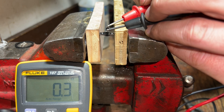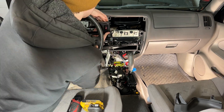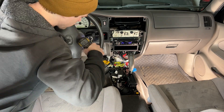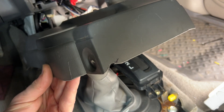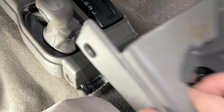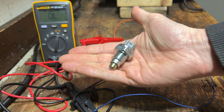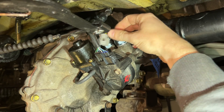I had to know what went wrong with the position switch. The switch consists of two electrical contacts, a bridge, and a plunger. When the plunger is depressed, it pushes the bridge between the two contacts, completing the circuit. The bridge appeared to be made of copper but was black with oxidation. I measured the resistance across the contact area and got inconsistent readings, leading me to believe the failure was due to poor electrical contact. I cleaned the contact area with sandpaper and retested — readings were much more consistent, further proving the theory. I was awaiting a new switch, so I reassembled the interior. With the new position switch in hand, I tested it — it worked very consistently. I installed the position switch and gave it another test.